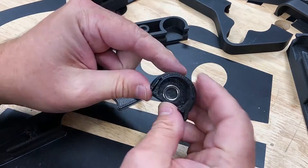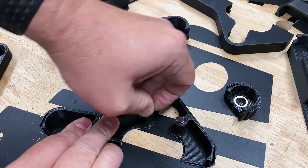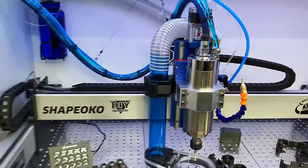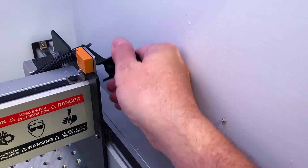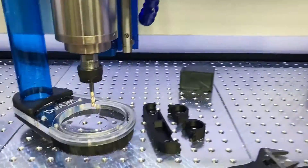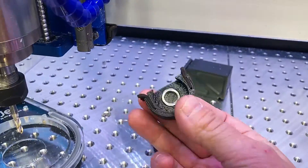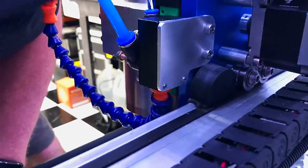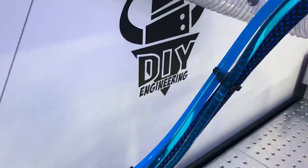With the leather scrubbers cut, I installed them on the 3D-printed dust covers. The last step was to install a few magnets in the respective mount holes to hold the covers in place without the need for hardware. For covers that mount directly on the wheels I used ring magnets for a strong and perfect snap. With the covers ready, I mounted the top and bottom Y-axis dust covers — the top consists of two pieces and one more for the bottom wheels — taking about two minutes to install with no tools required. Next, the X-axis covers are installed; top and bottom covers mount directly over the wheels via ring magnets on the bearings, and they work with both the stock Shapeoko Z-plate and the aluminum HDZ by Beaver CNC.